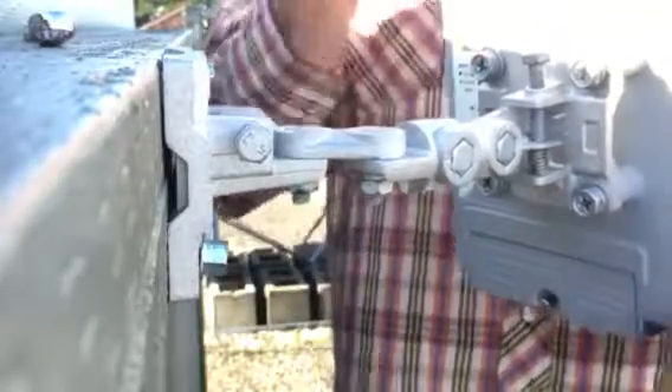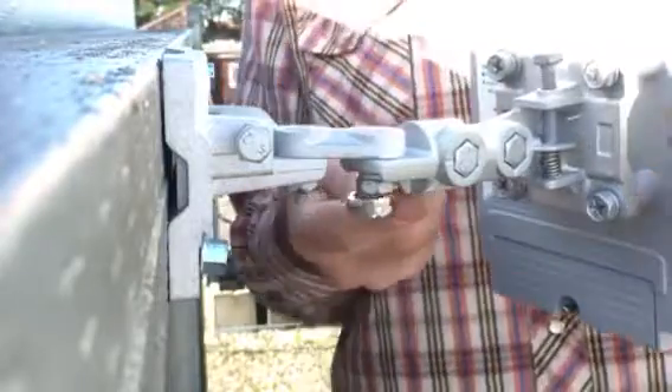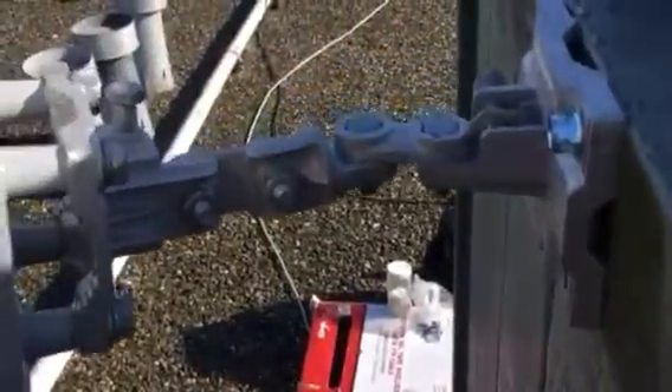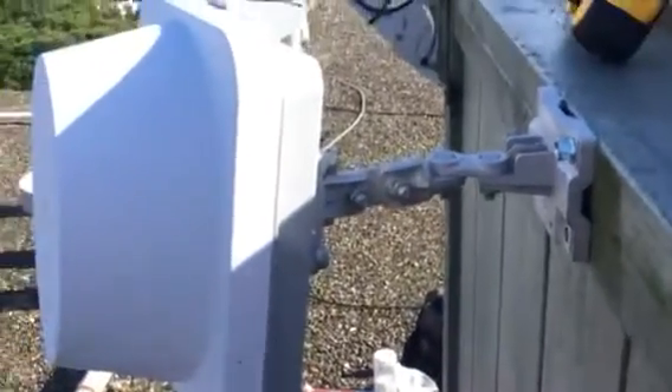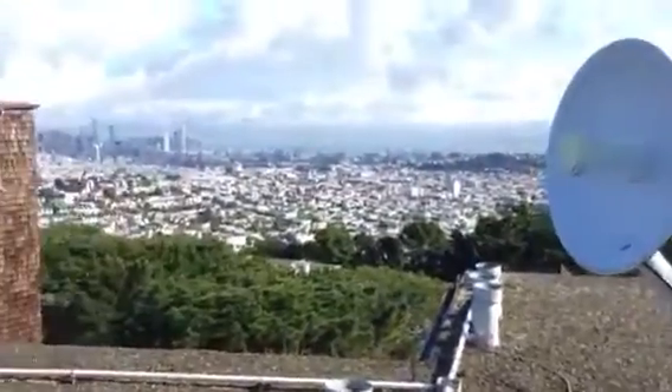And then I'm done — rock solid, works great. This one's a little loose here, I haven't done the left-right yet. That's the tutorial on how to align the Ignite Net MetroLinq default mounting bracket. Instead of mounting on a pipe, I chose to bolt directly to the wood. There's plenty of degrees of freedom from this mount — if I don't have to mount it on a pole I prefer not to; I prefer to face-mount it. San Francisco, 2018 — year of 60 gigahertz!